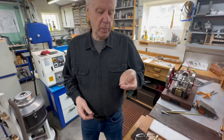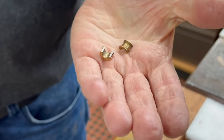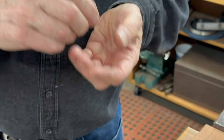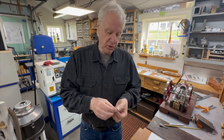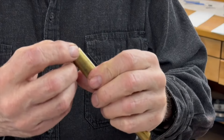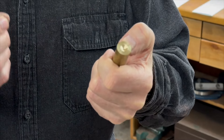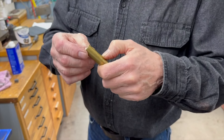This video is about making split bearings for connecting rods and crankshafts, because sometimes you have to be able to put it together with a split bearing. The method you use is the whole secret to it — it's not very difficult if you do it in the right order. For demonstration purposes, I'm going to use a large piece of brass instead of bronze to show you the proper way to do it in the proper order, because that's important. You would normally use bronze.